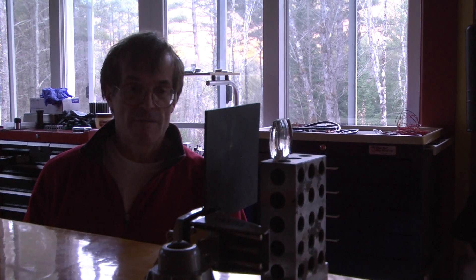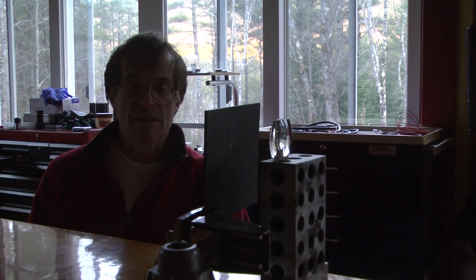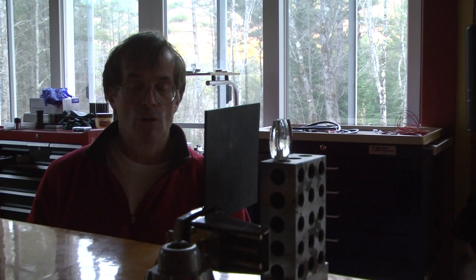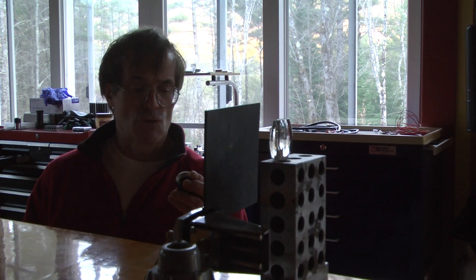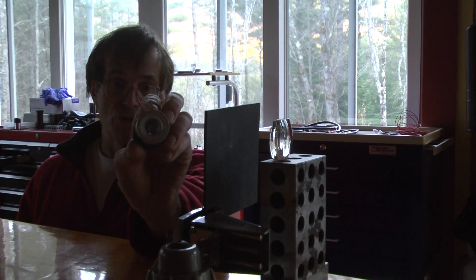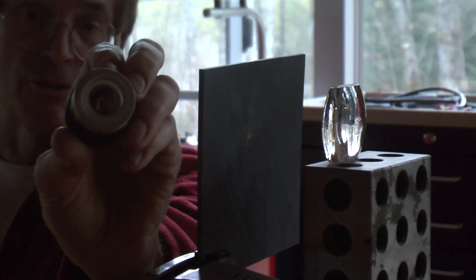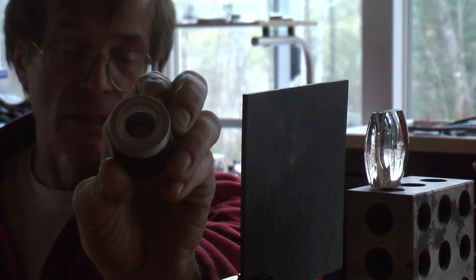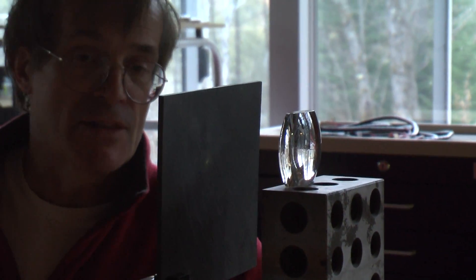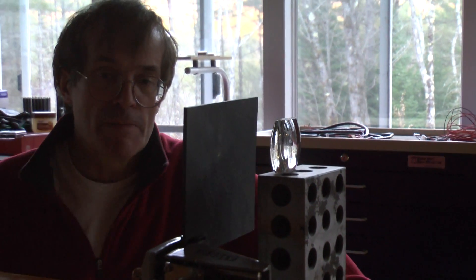I've had a chance to take off the plastic and warm the laser up for a few minutes with the oxygen running through it, so it's ready to fire. In front of me is a ceramic target positioned about three meters from the laser, dialed up to about 25% of maximum power. That's about as high as I can go with the conventional optics — I've ordered some special optics with higher damage thresholds. This lens here is an example of what happens when you run the laser up around 30-35% — blew it up in one pulse.